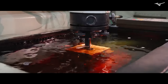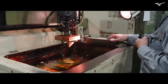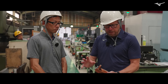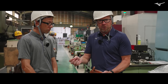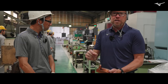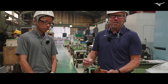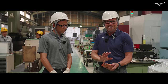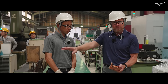What we're looking at right here is the Mizuno Pro 243 7-iron EDM tooling. Over here, the CNC machines are making the molds for the overall head. In the case of EDM, we use it for the score lines — we want to stamp or press the score lines into the head within our precision forging process. That requires extremely tight tolerances in the score line geometry. There are rules that govern score line geometry, and we want to go right up to the level where we have the appropriate amount of spin without anything illegal happening.